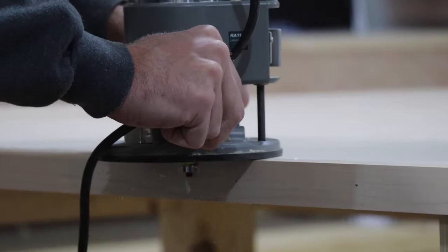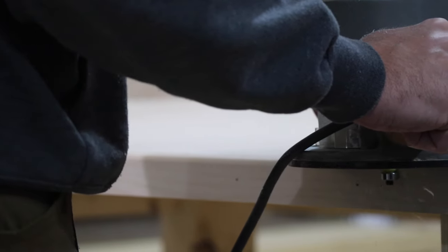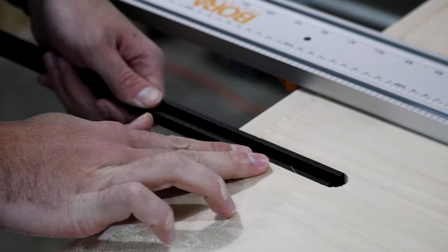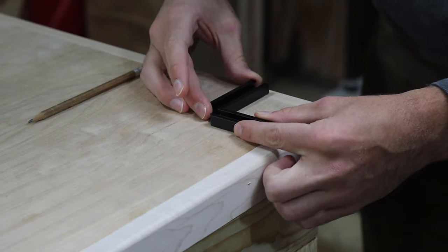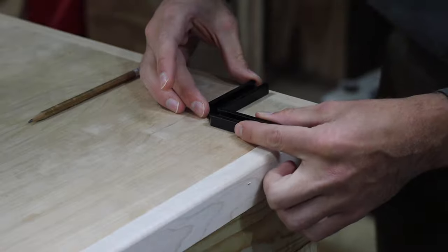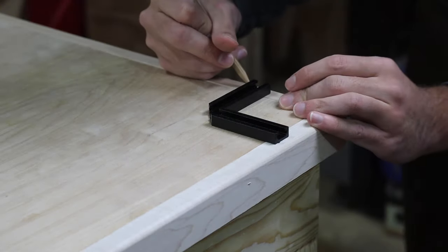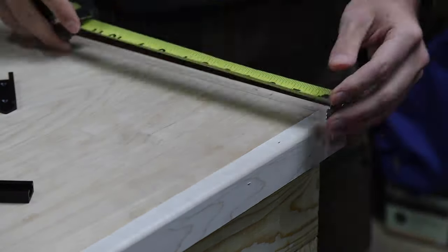To make things a bit more hand friendly, I broke the edge with a 3/8 inch roundover bit. I did a test slot for the T-Track and I nailed it the first try. Now when you're routing out T-Track, you've got to be pretty precise. And you know the old saying — measure twice, cut once. Well, I'm more of a measure four, maybe five times, cut once kind of guy. So this is right up my alley.